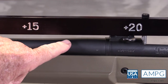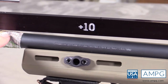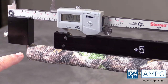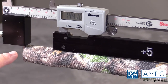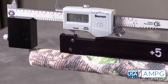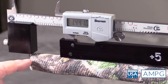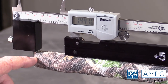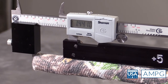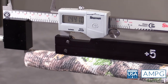We have the fixed pin at the 20 inch mark. The pin on the movable jaw of the caliper is against the barrel at a tangent point. The reading on the caliper is 1 inch 441. So our total reading from the end of the barrel to the beginning of the receiver is 21 inches 441 thousandths.